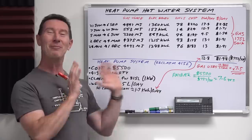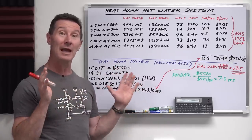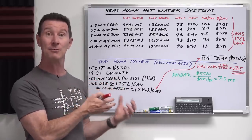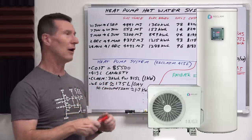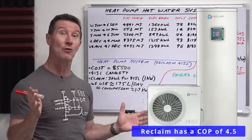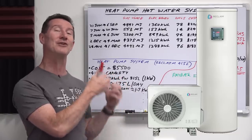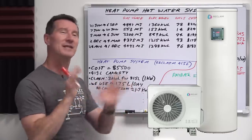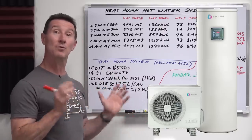This is not a regular electric hot water system — it's a heat pump, just like an air conditioning system uses, so it's much more efficient. The coefficient of performance, or COP, is like six or seven. That doesn't break the laws of physics. It's not that you get seven times the power output; it's that you get seven times the equivalent heat energy out compared to what you put in as electricity. That's how air conditioners work, and the heat pump hot water system works the same way.